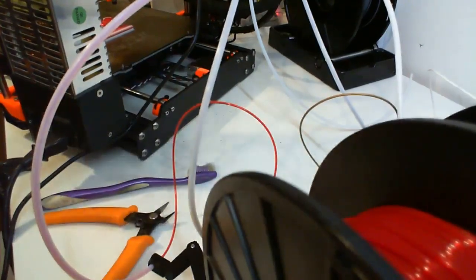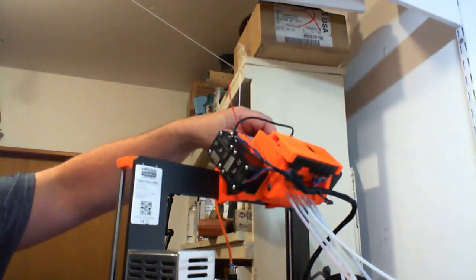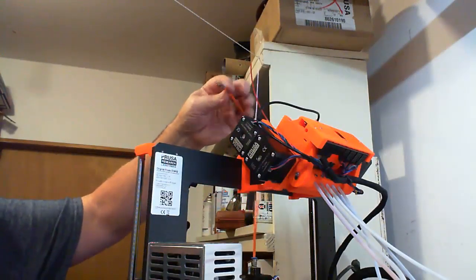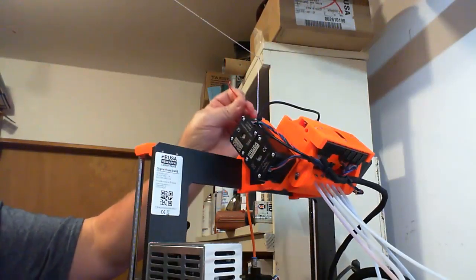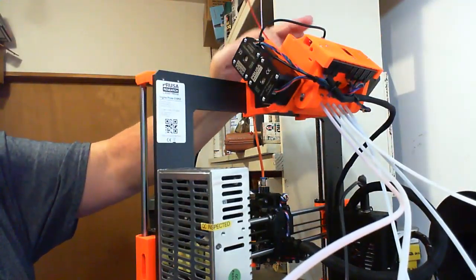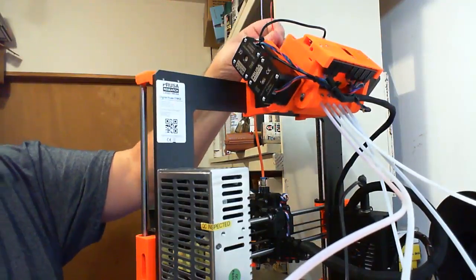And I took a gander, just looking. I took this off. Let's do that because why the heck not? So I'll aim it up this way. So what I'm doing is taking off the orange Bowden tube, okay, and slide your filament through that, and it's nice, you know, fairly free. So most of the friction is either from this Bowden tube, you know, it's a fairly long Bowden tube, or it's from the little tubes inside. It's not rubbing on the gears because the gears are lined up over here, and so it's just freely passing through there.